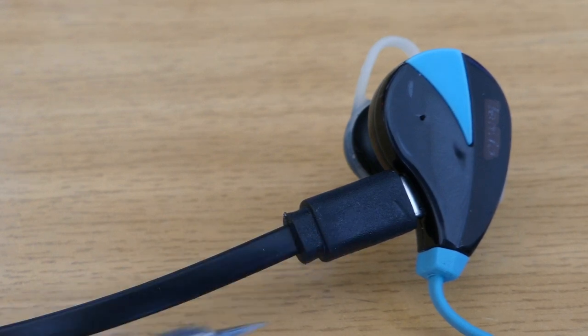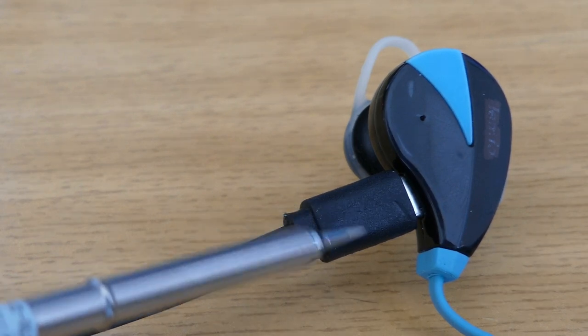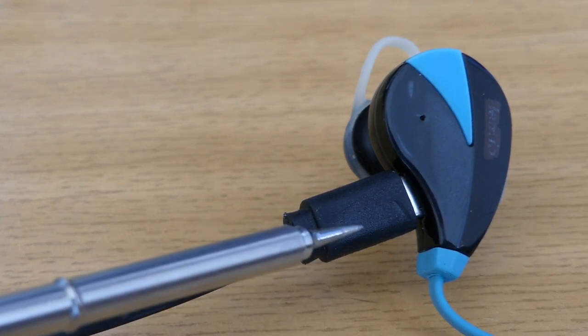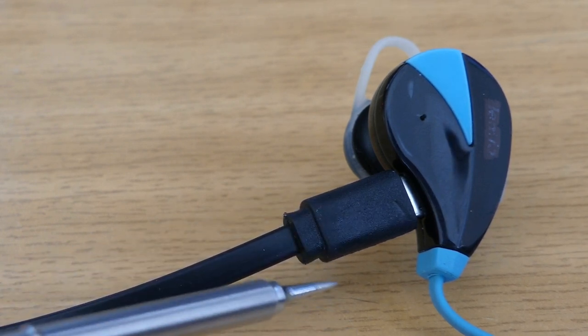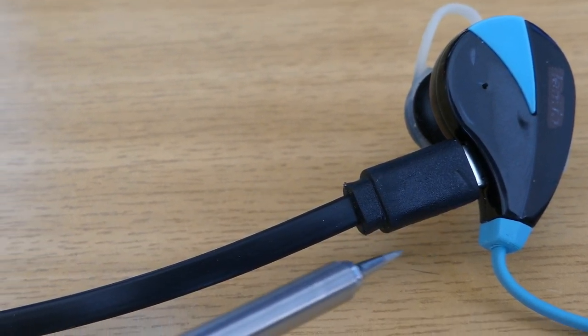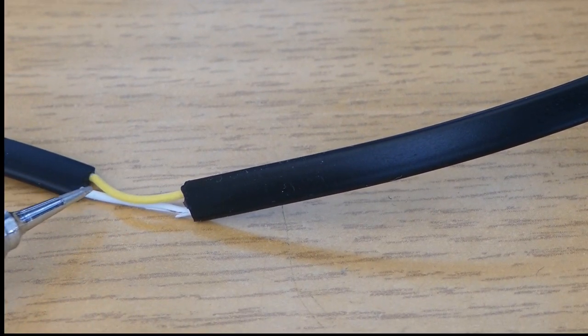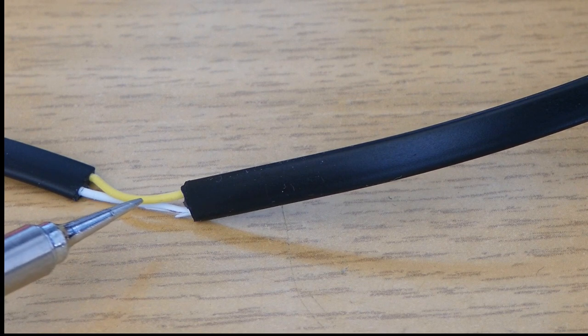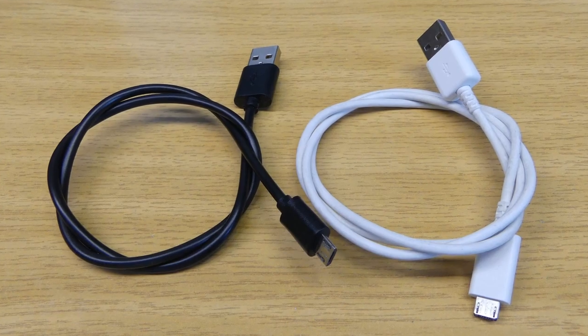But you also have to provide a USB cable in case the user doesn't have one. But you don't want to provide one of these fancy USB cables with two data lines, which you don't use because you only need power, and shielding for data integrity, because it costs lots of money. What you provide is just a cheap USB cable with just two lines to transfer power. Nothing else. Problem is that you can't figure out just by looking at the cable what's really inside.